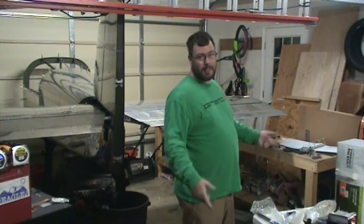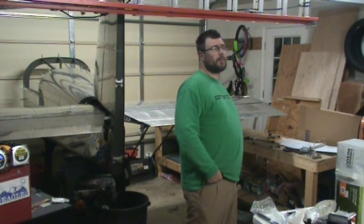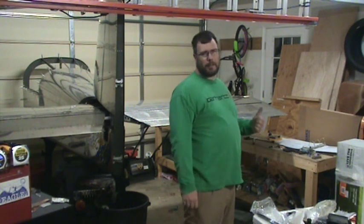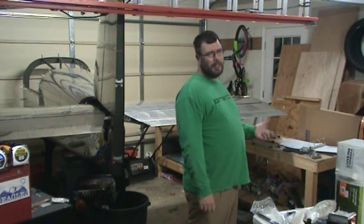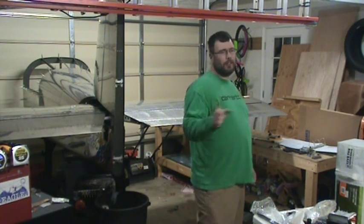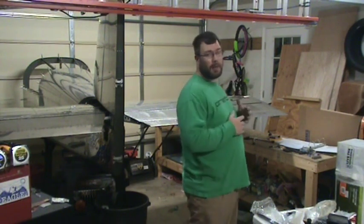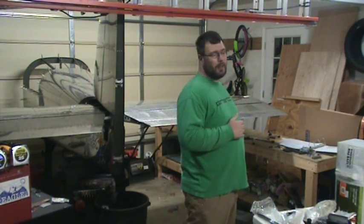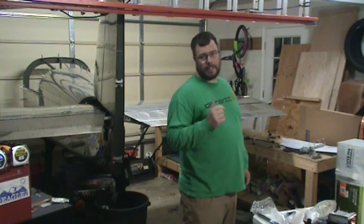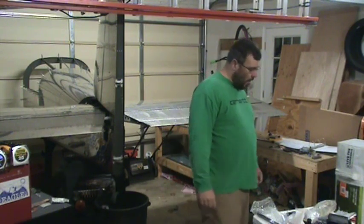So, in the meantime, I'm going to use a 9-volt battery to test. You could get away with using 12 volts, but why bother? And when you get to testing your position lights, like for the light I'm buying, if you stick a 12-volt battery supply on it, it'll damage the light, and then you're out $100.